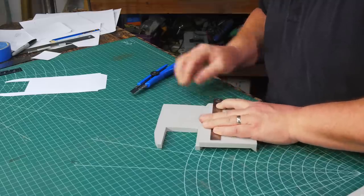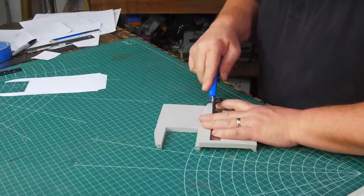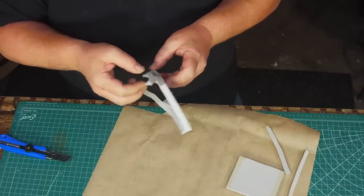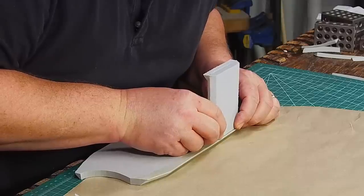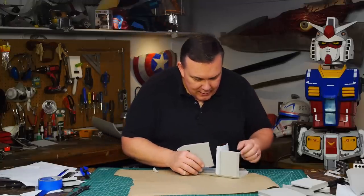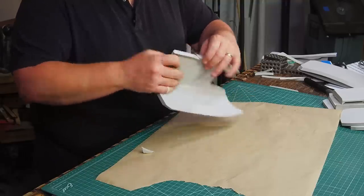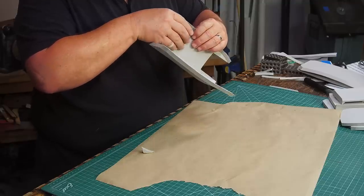The other two sides of the forearm box are made out of a couple of smaller 10 millimeter panels and they need a cutout for the elbow joint. By gluing the angled pieces I cut off from the big side panels to the inside edges, there's more surface area to glue the panels together and they should be a little stronger. Little pieces of paper help to keep the contact cement at the seams from prematurely sticking together. When I'm ready to set the seam I can pull the paper out and line up the parts — much easier than trying to stick all the sides together at once.